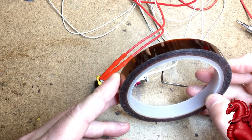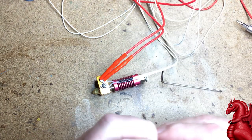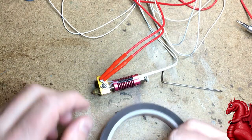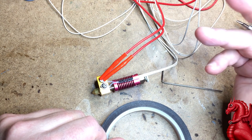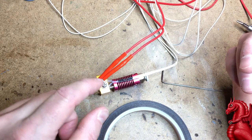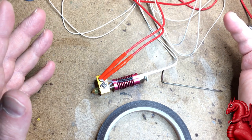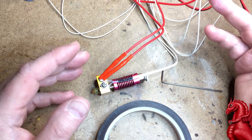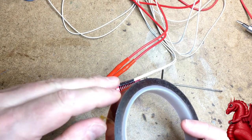The last thing I'm going to do is apply some Kapton tape as an added safety measure. Some Creality printers come with this, some don't, but I do this to all of mine after any hot end work. It helps keep the thermistor from popping out — if it comes out it will read room temperature, and the printer will keep pumping current into the heater block because it thinks it's not hot enough. That sets up a thermal runaway condition. All current Creality printers ship with thermal runaway protection, but this is a simple mechanical safeguard on top of that.